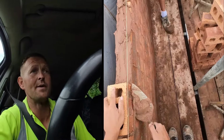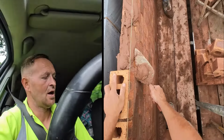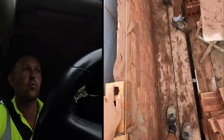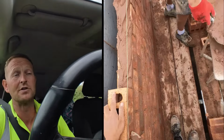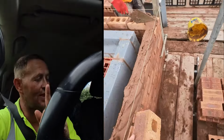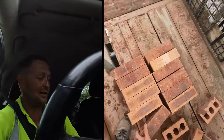And you'll be surprised how many more you can get down, rather than him going one end and you going the other end, and it saves you both having to drop out to get buckets as well, or one of you is at least working all the time. And if he gets that far in front, which he won't, he can start jointing at the same time. If your man can spread and get it jointed at the same time, and then he can start laying some back to you, you have got yourself a good second man there.